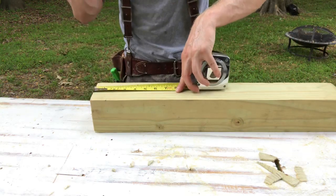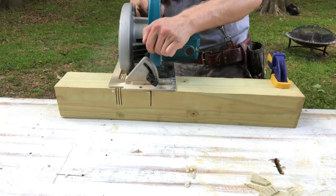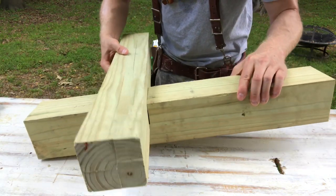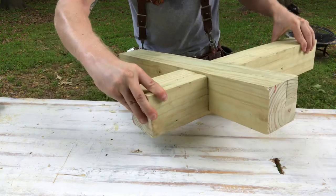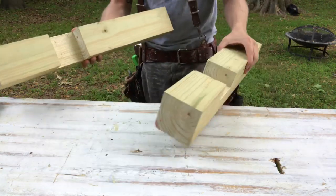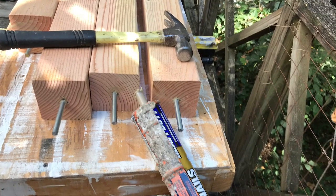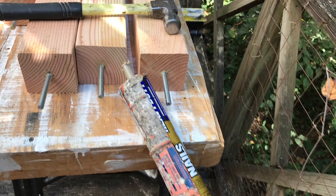When the first crosslap is clean, just repeat all the steps with the second piece: measure and mark for layout, set your perimeter cuts, make your freehand passes carefully, then break out the excess material and clean the floor. When both crosslaps are done, you get the satisfaction of sliding the two pieces together for a quick test fit. If their tops don't quite line up, do a little more chisel work on the floors at any high points. If you're making structural crosslaps, you can permanently join the pieces with fasteners or adhesives. Or if you're making something mobile like my arbor, use the threaded rod technique from my ebook — it worked out really well and made it easy to get the pieces together and apart in a short amount of time.